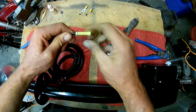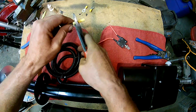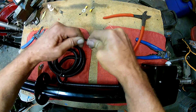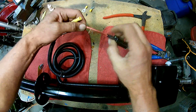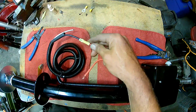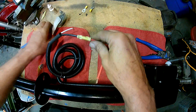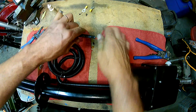Go ahead and just twist the wire on, select the appropriate crimp, and make sure it's all the way in there before you start — and give it all you've got. Before you continue, give it a pull test to make sure that's not going to come out. Make sure it's got an excellent crimp. Now we want to double-check we're going to the load side — just a little twist of the wires to make sure they're all together and you're not going to get any fray sticking out. Again, make sure it's pressed in as you start to crimp. Give it all she's got. Do one more pull test — that thing isn't going anywhere.